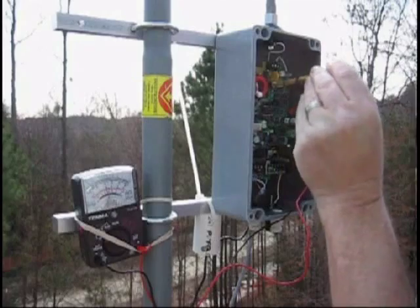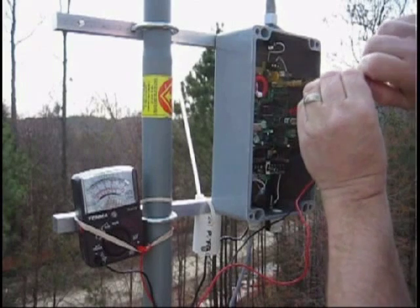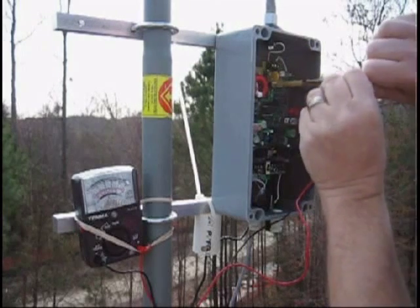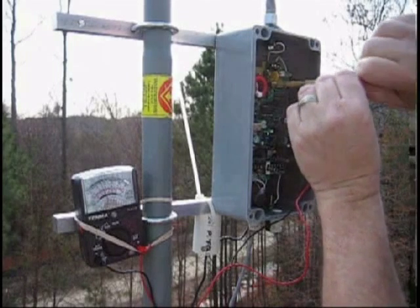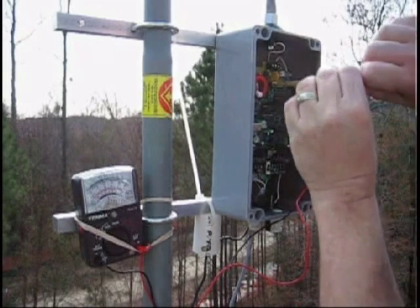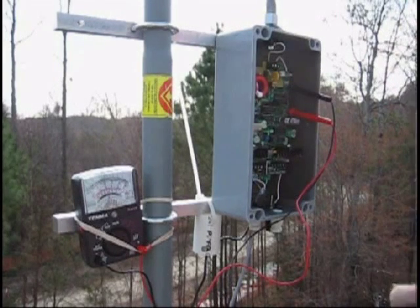You need to find a rolling peak, just like I showed you, where the meter is going to peak. What's happening is you're finding the resonance of the circuit. See how I'm turning it clockwise and it's going back down again. Now turning it counterclockwise — see how it went up and down. See how I've just found the position of the cap tune where the voltage is at the peak. At that point you're tuned.